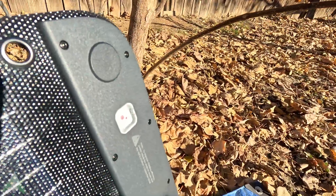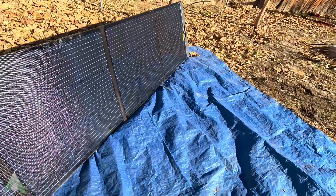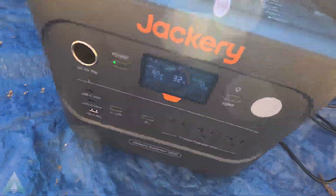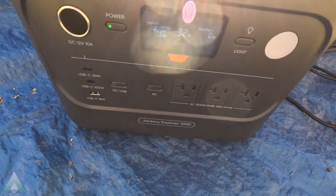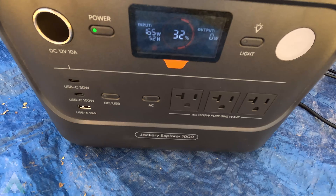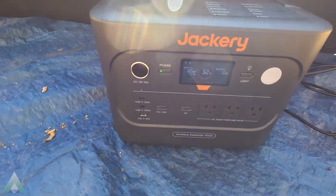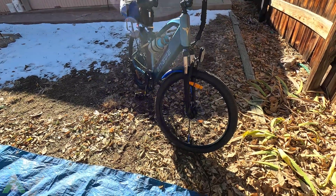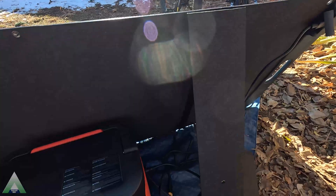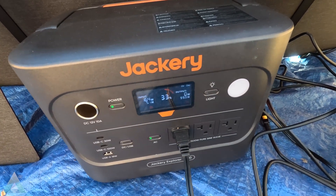From an IP rating perspective, Ugreen states on their website that they're IP67 rated, so in theory it should have some waterproofing capability. However, the manual did not state that, so we shall see. In this winter time frame, I was able to get 165 to 170 watts for a couple of minutes here and there. In the summertime, hopefully we'll get closer to the 200-watt rating. From my testing, I was able to input voltage into my Jackery unit while also charging my e-bike battery at the same time, and they continued working without issue.